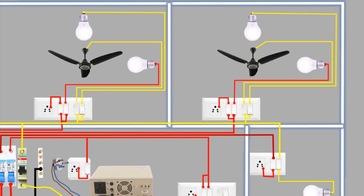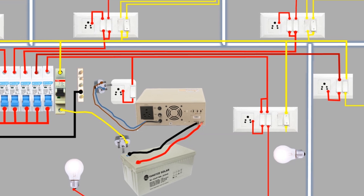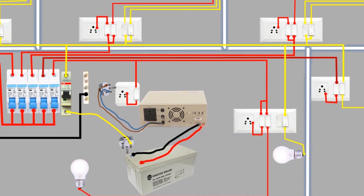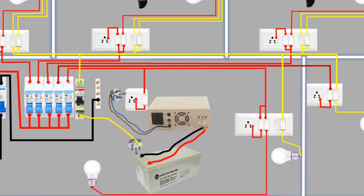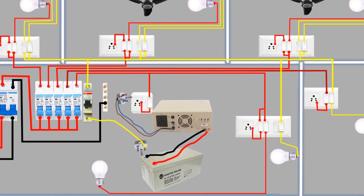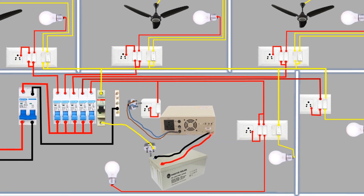In the corridor, we give the inverter supply using a wire from the inverter supply line connected to the switch. We will control only one light with the inverter supply, so the wire from the second terminal of this switch connects to that light. The inverter supply phase wiring is now completed. Note that you can use separate MCBs for every inverter supply by installing additional MCBs in the distribution board and looping them with the respective wires.